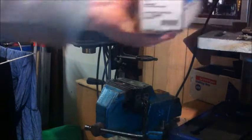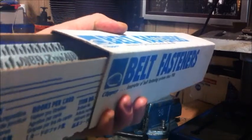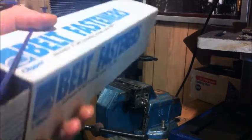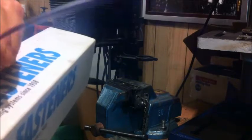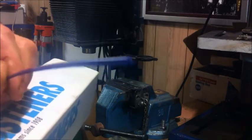And now this is a box of Clipper fasteners, number 2, and G for galvanised. These aren't real expensive. What you've got to watch when you're buying them is that this one says without pins, and most of them are sold without pins. So you need pins for the first time you set it up. And if we look in here, they're plastic coated. I think they used to be catgut, but they're plastic of some sort now. And that's so the staples grip in and the pin doesn't fall out. So that's what it looks like. Focus on that there.